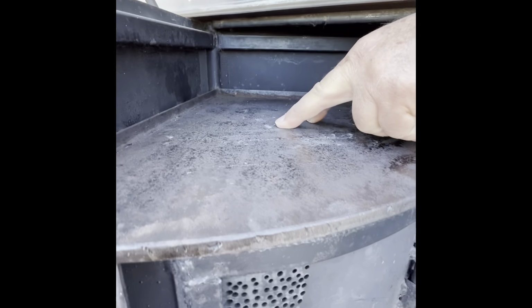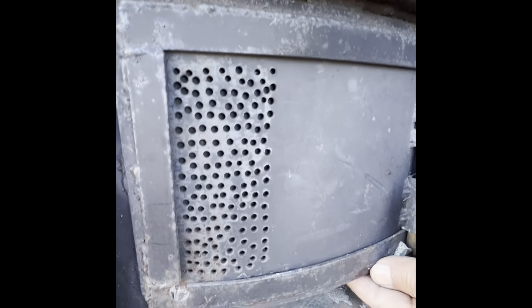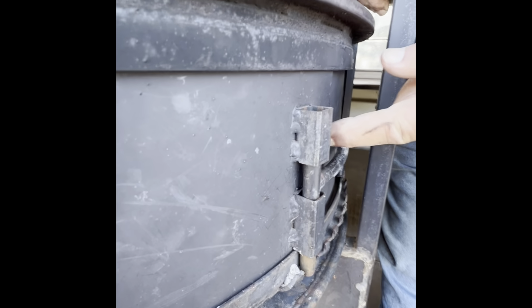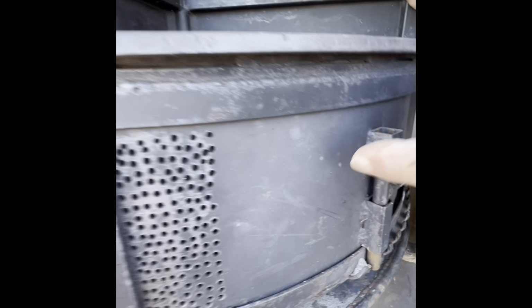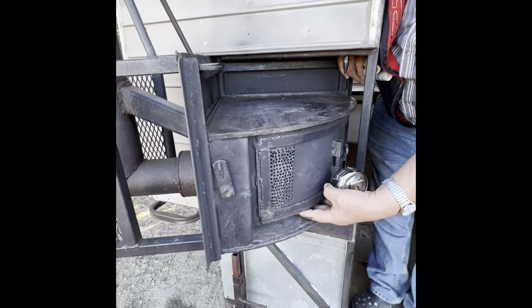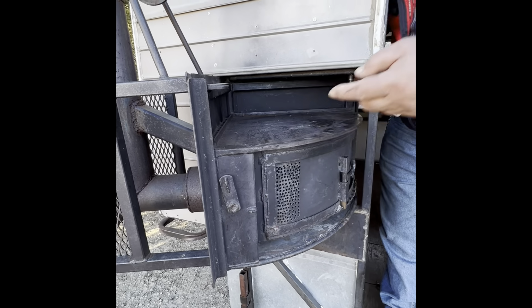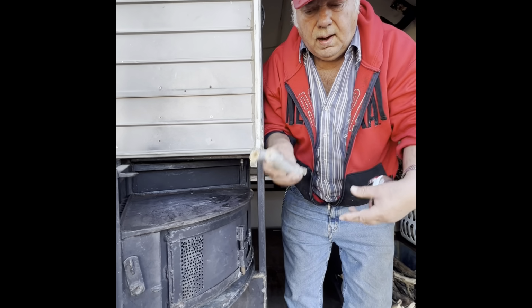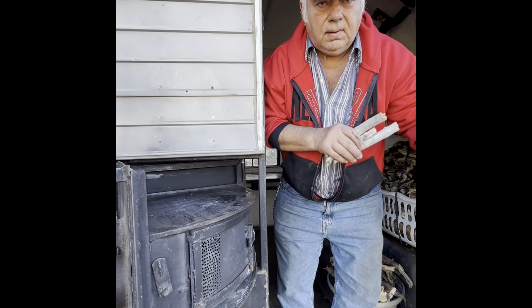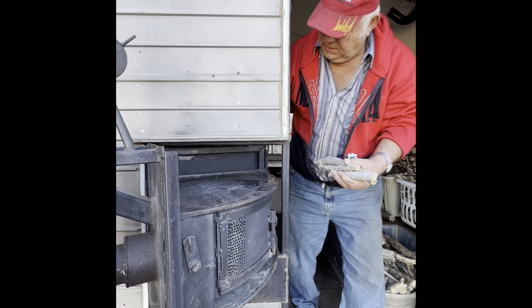This is, I think, 3/8 flat. There should be a chunk of 3/8 flat down here. And then I think this is some of that 1/8 inch plate. This here's like, I think, some 10 gauge. Okay, but that's so we get air to come around this thing and air to draw in through here, so this doesn't get hot underneath. And none of this stuff gets hot because it's actually like a fire out there in midair with air going up around it. Okay, and then I still put my wall shields up inside here.